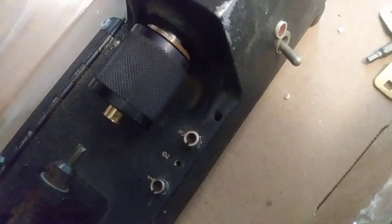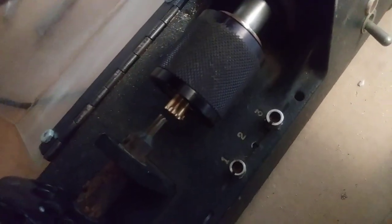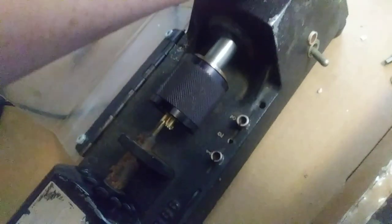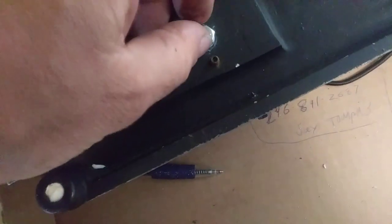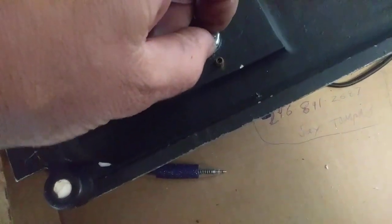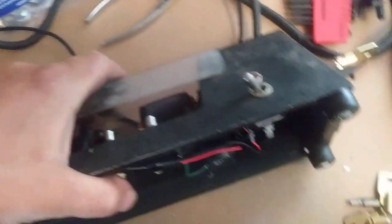Let me put a key on here so it's easier. So you're going to slide it open to an existing cut, and then you'll slide it down. When you're holding it, see how it's in the cut right now — the cutter? While you're holding it, you're going to flip it over when it's in the cut. And you'll tighten this up until it's snug, and then you'll tighten these up. What that will do is lock into the position to the right cut, or the right depth.